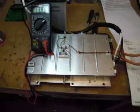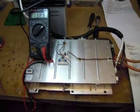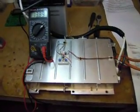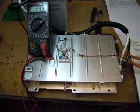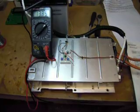The range of adjustment with the PWM and the pot seems to be from about 12.3 to about 15.2 volts. I think the PWM is not actually going to be necessary because I've tried it just using the pot and it does adjust a bit.